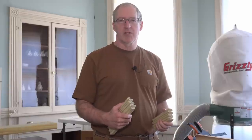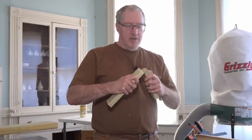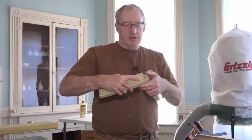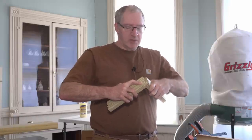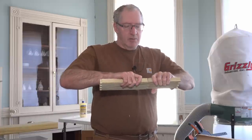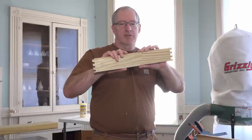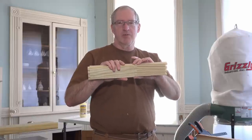Here we have some nice box joint fingers, and let's see how the test cut goes. Well, right away, I can see that the fingers aren't long enough to reach the corner, and that's because the thickness of my wood is thicker than 3/8 of an inch, so I didn't take that into consideration. Thicker wood means longer fingers. The other problem is, when I put it together, I have a bit of an offset here. See how it steps down and steps up here? I'm not sure where that offset came from. If any of you are woodworkers and understand what's going on here, please let me know.